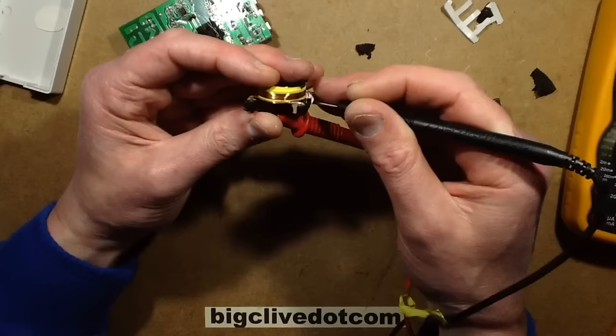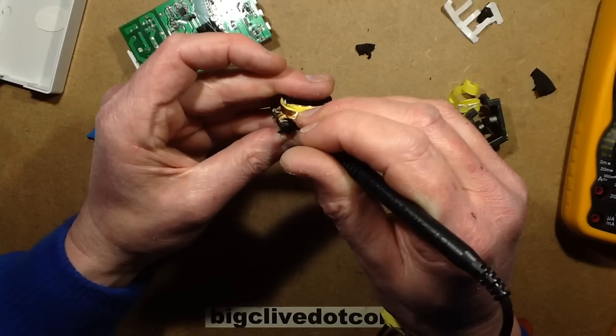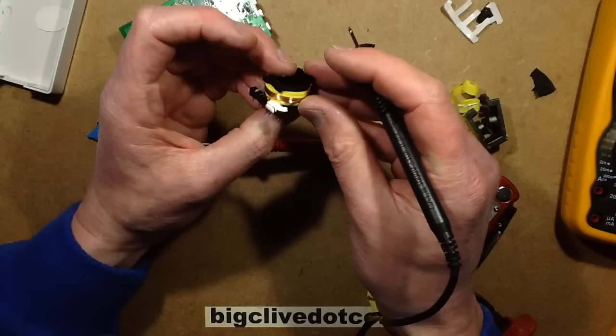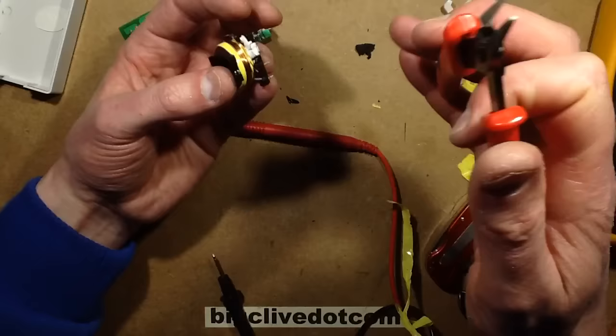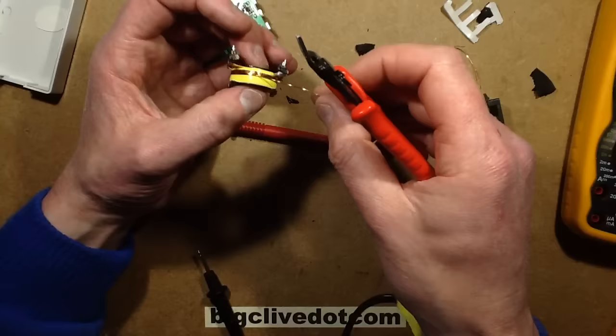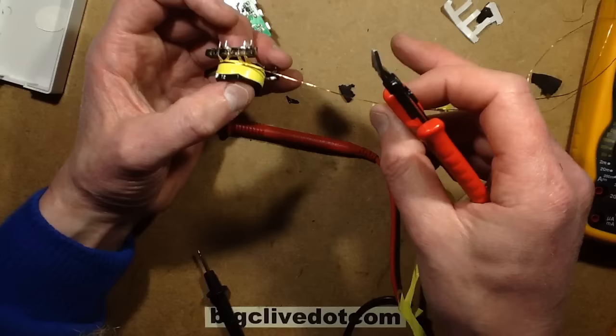This is where old-fashioned mains-frequency transformers really won, because they had the separate bobbins. So this is possibly the feedback winding here on the outside — and it comes very, very close. It actually goes right across this output winding. All these windings under there are just rammed right onto that winding — the output — wait, no, that's not the output, that's the primary. The primary does seem to have that thicker insulation on it, but then there's no major separation. The very fact that this bent down a bit during disassembly — it could be this one that was shorting.